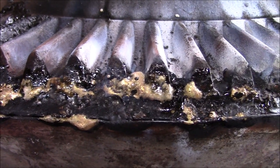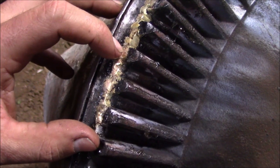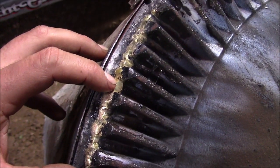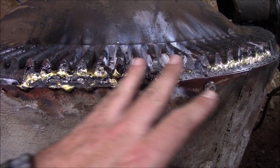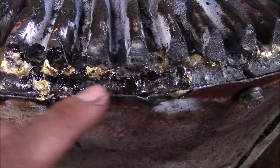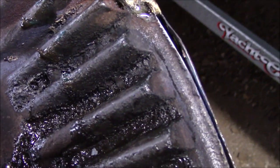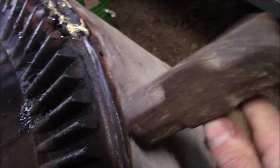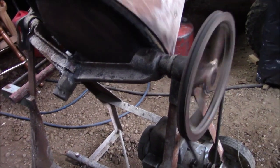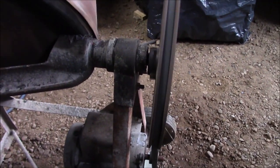Might have to do a little bit of grinding in between those teeth. We're going to throw one more rod at the inside here and then probably call it a day. Had to run the grinder over some of the high spots down at the bottom of the teeth. For some reason this one middle section just refused to braze very well even though I cleaned all three pieces the same way — that middle one was a bear. Now we're going to fill in those gaps with some silicone so the initial run of concrete doesn't fall through, but a couple little taps won't hurt either.